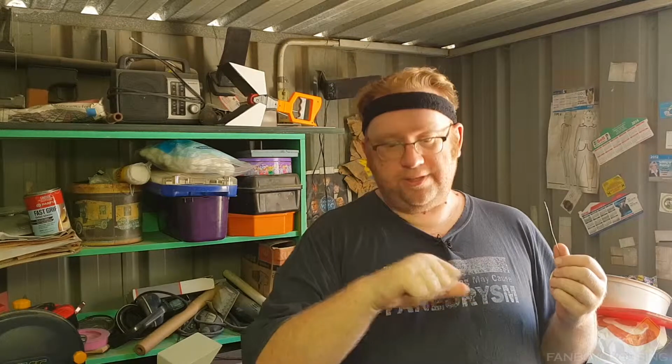It's not just metal. And there's a reason why this is bendy, because this actually has a lot of rosin in it. Now, rosin is basically a flux, and the flux is what helps bind the metals together, and it cleans and all sorts of things. I once worked in an electronics area where we just rosined everything, specifically because we're doing wave soldering. The wave solder is just literally a vat of molten solder. Think like molten metal, but just this stuff.